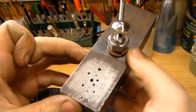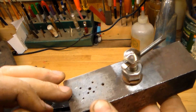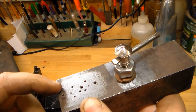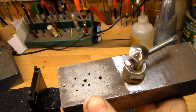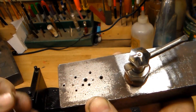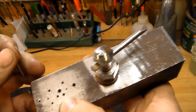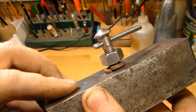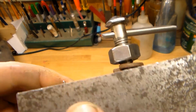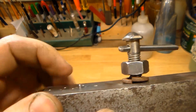You may have noticed the holes in the anvil block — these are there to get the first side of the pin started. I've come up with ideas for an adjustable fixture, but these holes are enough for most of my handle styles. I know from experience that the deepest one should be about right for this pin. Put the pin down in there and see how it protrudes just a little bit — that's what I want — then use a ball-peen hammer to form the head on the first side.